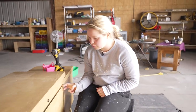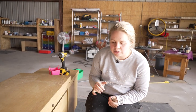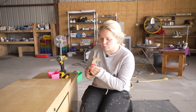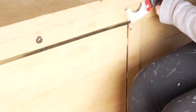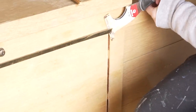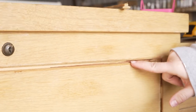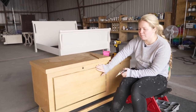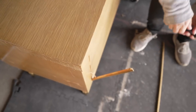The next thing we're going to be removing is this gold trim here. We were thinking about changing the color of it, but we ultimately decided it would be more modern if we removed it altogether. I'm going to take this multi-tool and shove it in there and start prying it back — I don't want to go too fast because I don't want to ruin anything. It's just glued into this little area. Sometimes you're going to see things you'll have to fix, so I'm going to take some Bondo and fill in these indents because it's a deeper gouge — Dixie Mud won't cut that. But overall, really easy to remove.